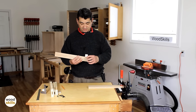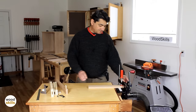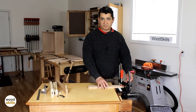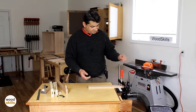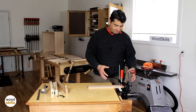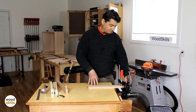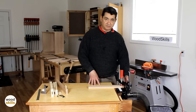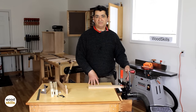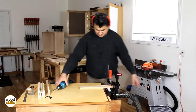So if this were twice as thick, I would need to raise the carriage to correspond to create that mortise. But because it's mounted vertically, it's a little bit difficult to do. It's not as easy because it keeps dropping due to gravity. So I've created the micro-adjust system, and I'll demonstrate that afterwards, but only after I've created the mortises because it's preset.